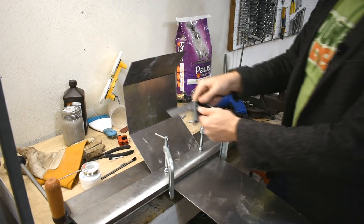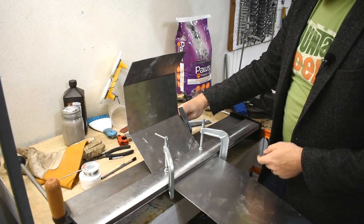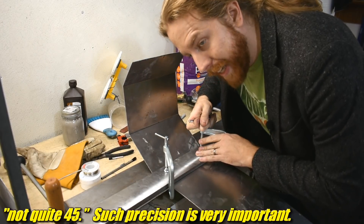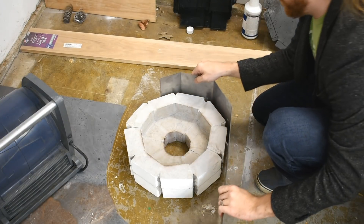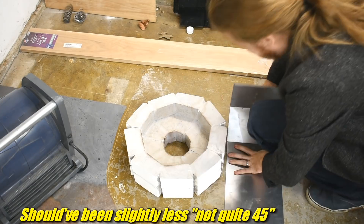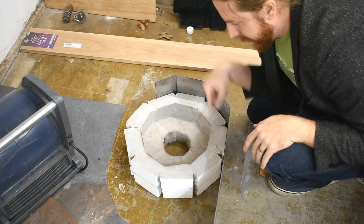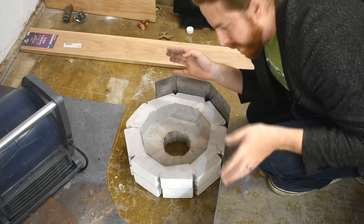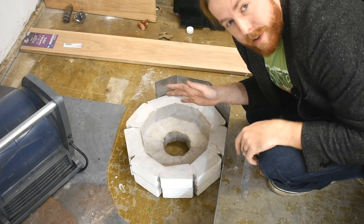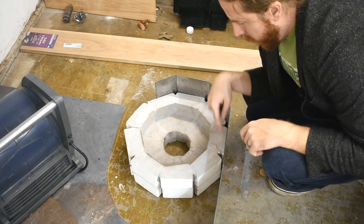So I kind of eyeball it and I take this out of there and check. This is a 45 degree angle from here, so it's not quite 45 degrees. Not quite 45 is what I want. And now we go check. I did mark this so that I have the same place to start with each time. Wouldn't you know it, it's not quite bent enough. There we go. Now I've got to do all this by hand because the base there, it's not perfectly round due to incompetence of the person building it. So this is more round, but I had to shave these down. And I didn't do a super perfect job with that — also incompetence, but it'll work fine. So now repeat that process all the way around.